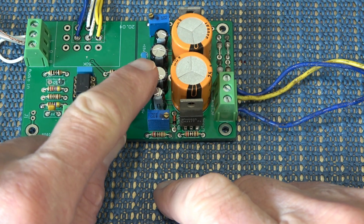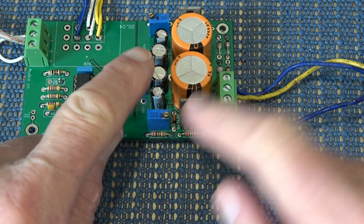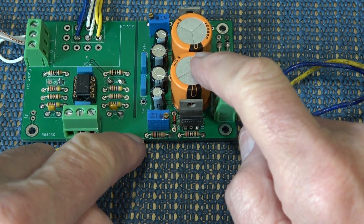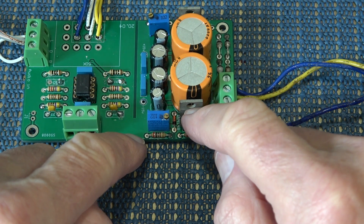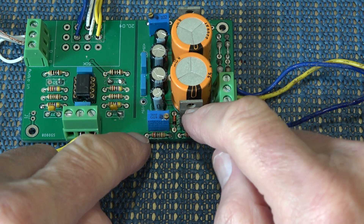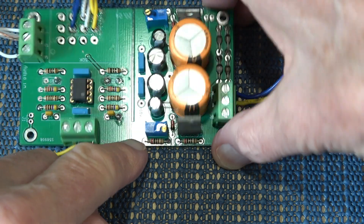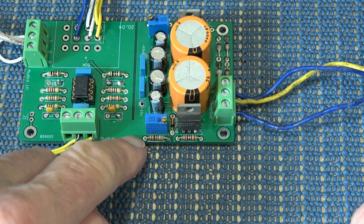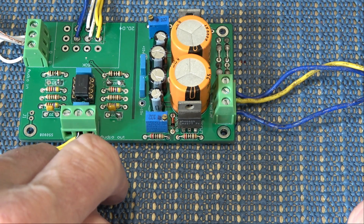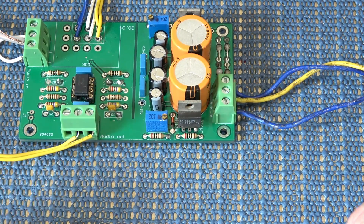Additional smoothing after the regulator is here. You tend not to have large capacitors on the other side of the regulator because you don't need it — you're feeding in really smooth DC from this side, and all you're doing here is bringing that down to 15 volts. There's another regulator on the other side governing the other 15-volt rail. That's all I can say about it really — it's almost textbook and it works perfectly.